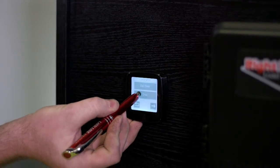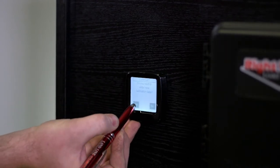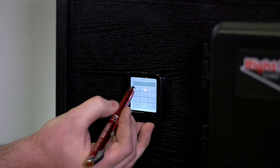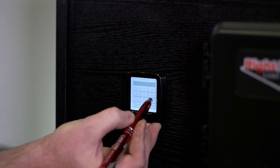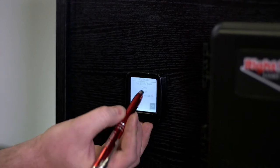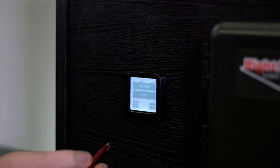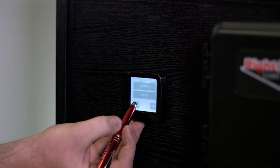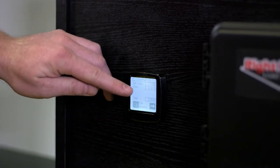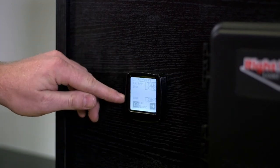Now we'll go to drive and we'll do empty. Do you want to enter new calibration data? You say yes. And our empty drive is 11,960. So we'll enter that in, 11,960, and just to confirm, hit yes. Okay, and we'll go back to the home screen, hit the weight button. And now you can see we've got 11,009 and 11,650 right there, and then our total.